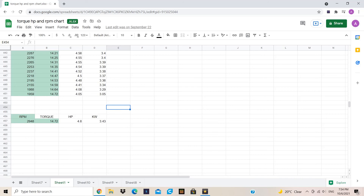With torque at 14.72, horsepower was 4.6 and kilowatts was 3.443. If you pause the video in the bottom left-hand corner you will see on the VESC tool what's being used, and in the top right screen you've got the Arduino output. The kilowatts is in the last row, so if you pause it you can verify the two and then work out the efficiencies — how efficient that motor is — but obviously you've got inefficiencies in the load bench, chain drive, hydraulic pump and everything else. I'd probably say it's not as bad as what that's actually making now.